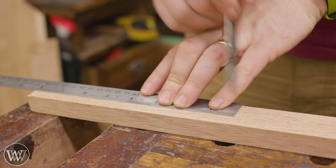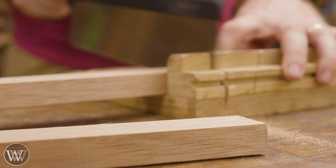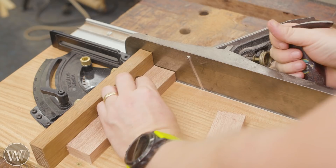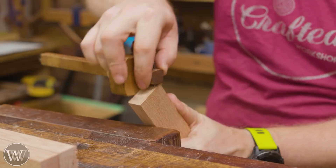I'm going to be laying out how big this square is going to be. In my case, it's going to be eight inches by eight inches, so I'm cutting the boards to eight inches long. What we're going to make out of this is all of the cross-hatching. For that, I actually need 10 pieces that will go at 90 degrees to each other — so we need 10 pieces that are eight inches long. We're going to cut them at eight inches and then shoot them down, and out of each of these blocks I'm going to be able to pull five or six strips, so I need at least two blocks set up.